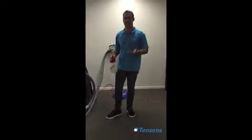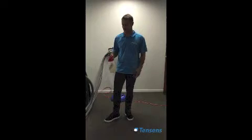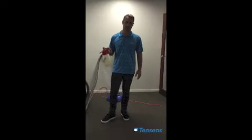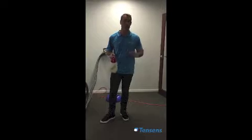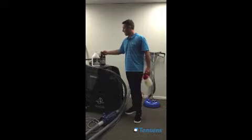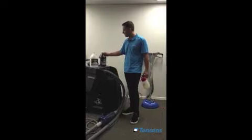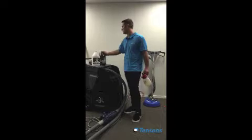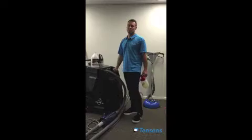Much like carpet cleaning, we pre-spray our tiles first before we start cleaning. Vacuum the tiles first to get rid of all the sand and dirt. Then pre-spray the tiles. It's a good idea to check which type of cleaner you're going to use: you've got your Viper Venom, which is your alkaline cleaner, and your Viper Peroxy Bright CTG — Concrete Tile and Grout cleaner — which is your acid cleaner. The Peroxy Bright has a peroxide in it to brighten the surface as well.